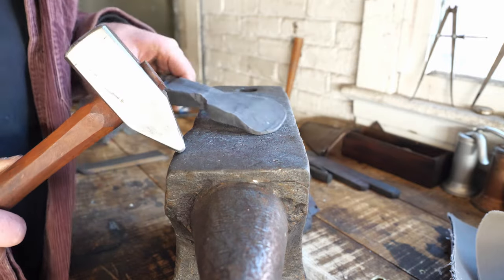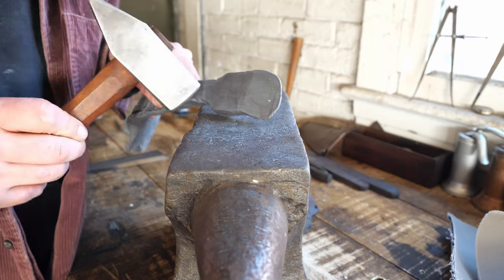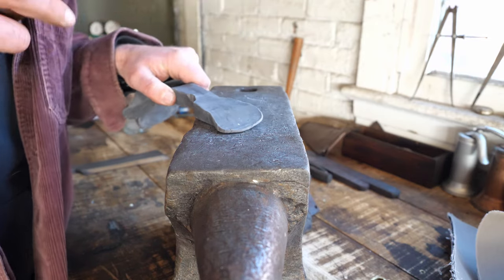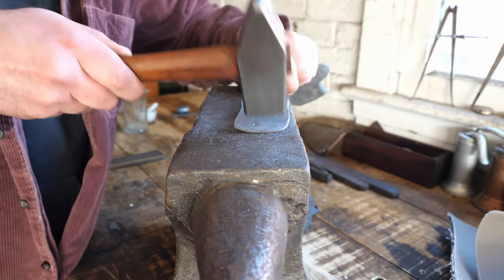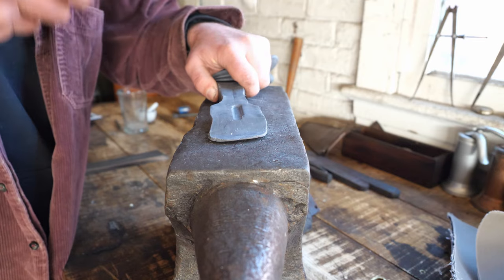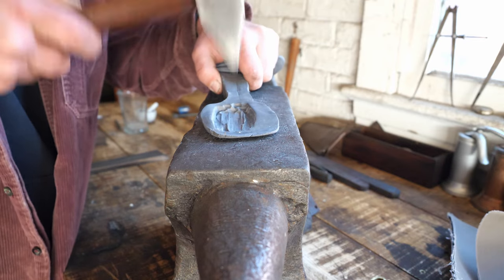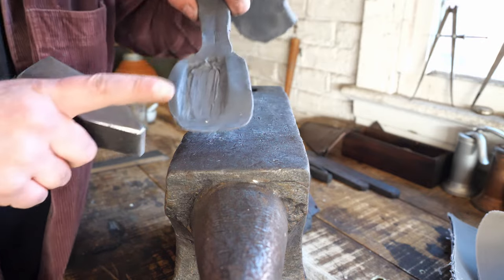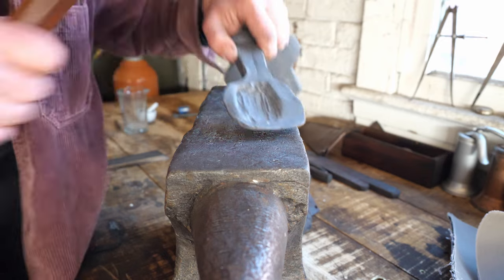Make sense? The ability to transform your material using only your hand hammer with this amount of control gives you a whole lot of power. So you'll notice I put this stubby chisel taper on here. And then what I do is, using the cross peen, I'm able to forge out the rest of this material without a dramatic change in length, where I want this up here to remain relatively rounded.